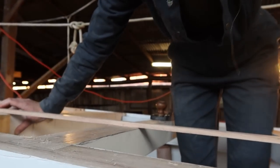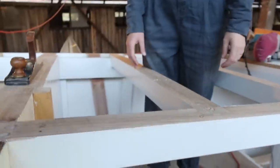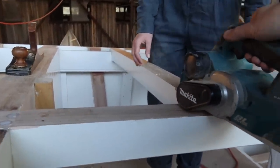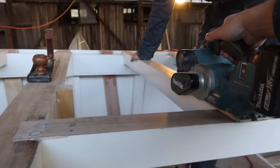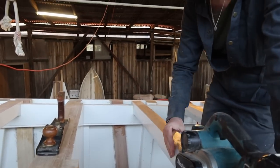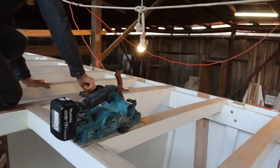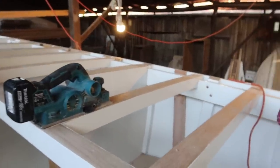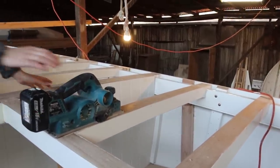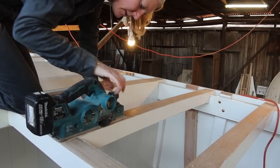It lifts up this one, but I reckon you should take one pass of the electric plane. Scary, but what you can do is set your plane and just come in flat, you won't get tear out here, and then just pull off just after where your hand is, just take the plane away. And do I still keep it on a slight angle? You should have set your angle now, so it should be all right. So you know your depth setting on the thing, just turn that anti-clockwise. Just give it a turn, it won't do any harm.